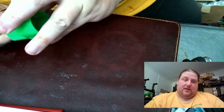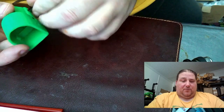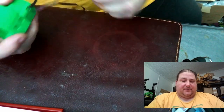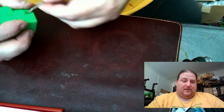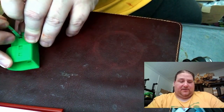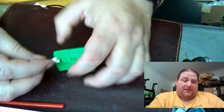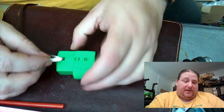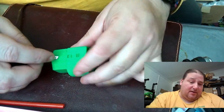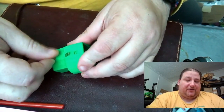There it is. Be careful with the nickel strip — it will cut you if you pull too hard and let it slide through your fingers. Push through, pull through until we get some through here. Now this goes back through this existing hole — put a little bend. There's a channel that runs along here, so feed it back through again and you'll see it pops right up out of that channel, just like that.